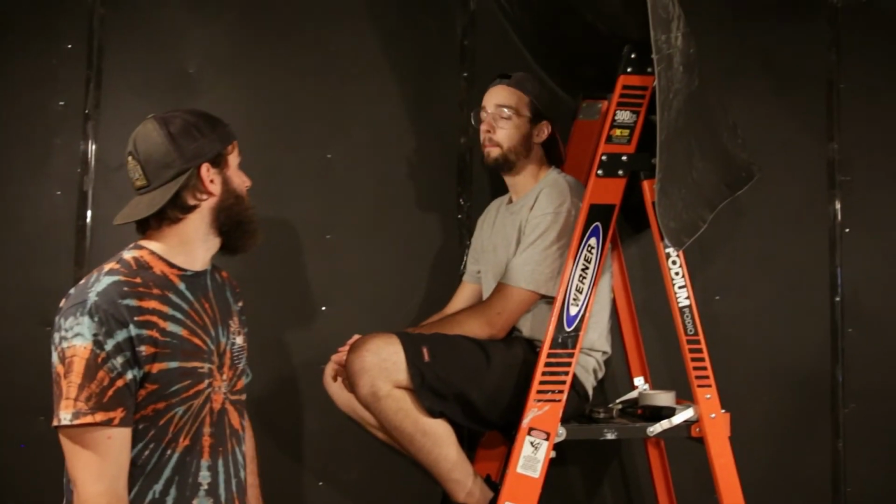So we're gonna close things out here. The long and the short of it is we started really early this morning. We wanted to put our new door in our new framed in wall and get that all sealed in. We ran into a ton of issues. We spent hours trying to get the door just right. We shimmed it all different ways and couldn't come up with the right solution. We had our friend Jeremy come over and come to find out the foundation is a little bit crooked and it kind of wasn't meant to be with that frame. So he really helped us out and got it good to go. My only piece of advice is if you're framing in for a new door, allow yourself some inches of space on top and to the side so that when you're shimming and trying to level, you have a lot to work with.